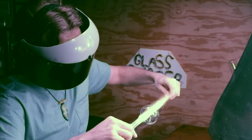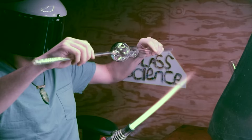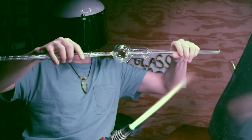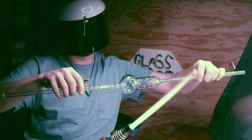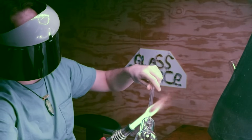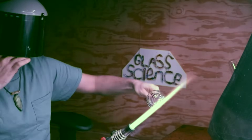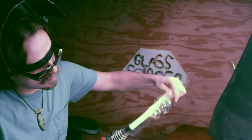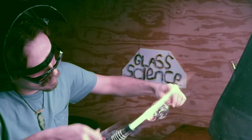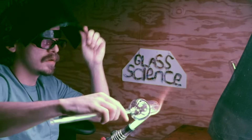To complete the seal, I'm going to heat up both sides very hot and very molten so they flow together in their liquid state. I'm trying to get that blow tube very straight on axis with the rest of the piece — you can see me flash a little bit of heat to keep balancing that out. To remove the other blow tube, I'm going a few inches away from the connection point because there's some stress built up from that seal. The radiant heat coming off the blow tube heats that stressed area back up to working temperature, so I won't have to worry about any cracks.